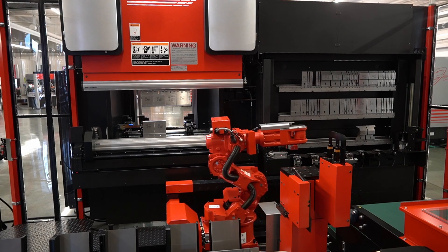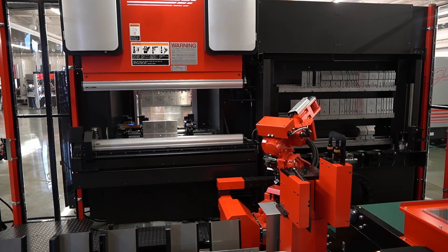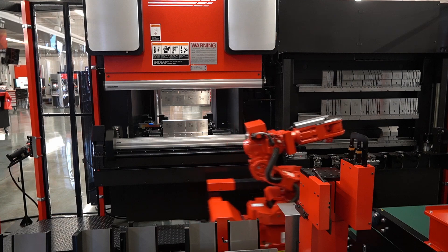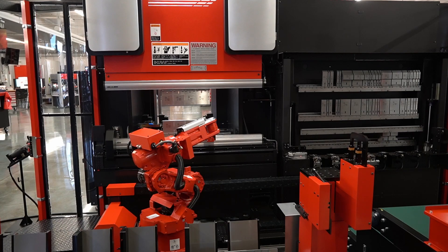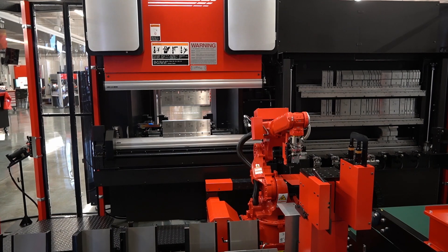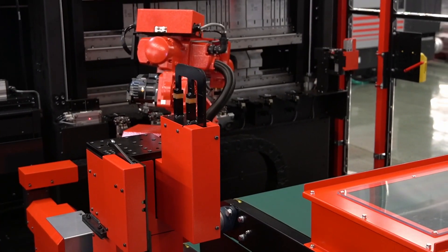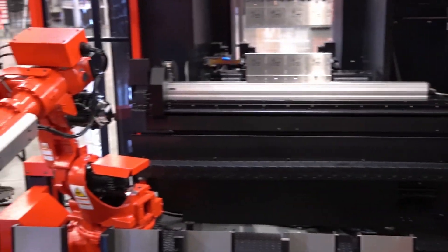So now it's doing the dies. After this setup is done, the robot will go ahead and switch over to a different gripper — the gripper that is commonly used for longer pieces to hold stability when the robot is doing its movements. It's going to change the head, the gripper, the end-of-arm tooling, whatever you like. So it's blowing excess air just to prevent any debris that would be in contact with the actual gripper hand or robot.